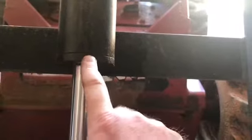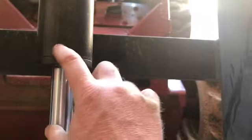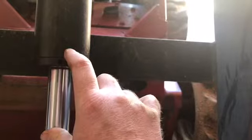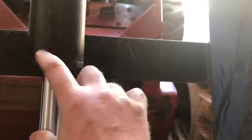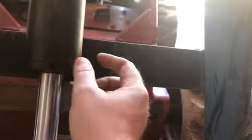I'm not going to take the other pin off, but what I'm going to do is start to unscrew the cylinder. This cylinder is just a straight screw off. Some cylinders will have these holes here and another hole for a metal band that goes around and holds everything in. If you have the rectangle hole, there's a metal band that needs to be fished out when you turn it, and it'll start to pop out the hole. You keep going around and around, and then the whole metal band will come out, and that's how you remove the top. But for this one, you just keep turning it until it actually comes out, and then your whole cylinder, or this ram part with all your pistons and stuff in here, will come out with it.